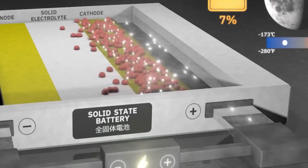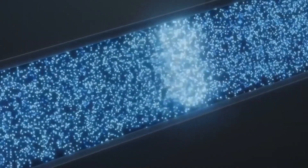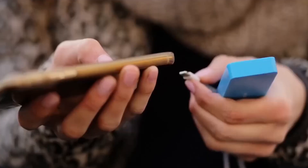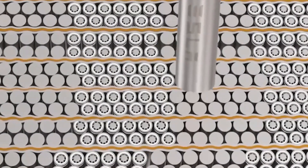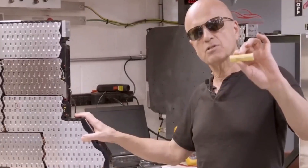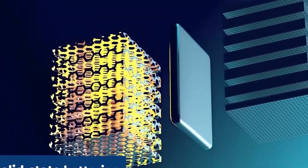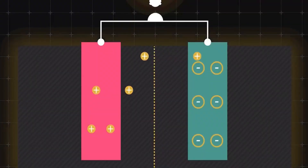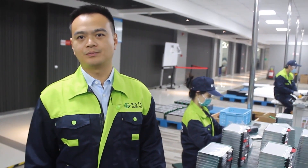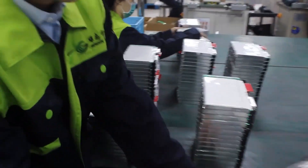So fast charging — that's it? The other upside of using graphene is its extended overall life cycle. Since graphene is more stable than graphite, it degrades much more slowly. As you charge and discharge a battery, the mediums that hold the electrons at the anode and cathode get a little busted up from pulling electrons all the time. The carbon atoms in graphene have super tight bonds, which, according to Electjet, afford the Apollo Ultra battery over 2,500 power cycles, compared to the usual 500. While that remains to be seen in everyday use, a five-times reduction in battery waste could well outshine the initial novelty of fast charging.